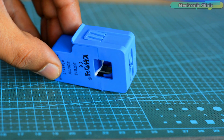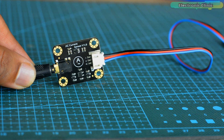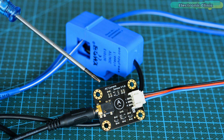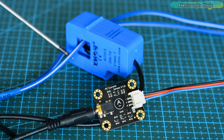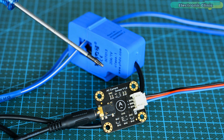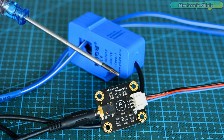The components and tools used in this project can be purchased from DF Robot and Amazon — purchase links are given in the description. Simply clamp the AC transformer probe on the AC line; the current transformer is connected with the current sensor module which measures the AC current. When current flows in the wire, a magnetic field is created proportional to that current. The current transformer transforms this into a small current, which the sensor module then converts into a voltage given as input to the controller for further processing.